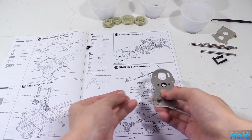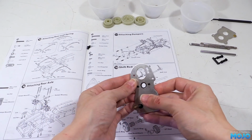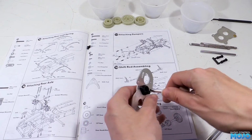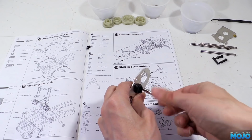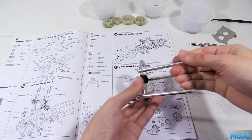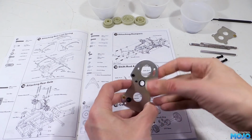That leaves the aluminium tubes. We're only installing 3 of them at this stage, so we've still got access to install the other bits later. They're attached with the M3 screws, and for now we'll just do them up finger tight. Once the gearbox is running, we'll pop them out again and add some thread lock.